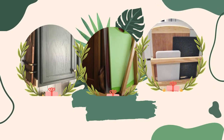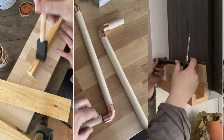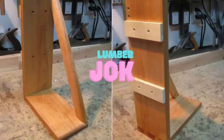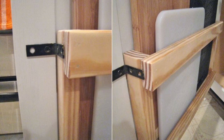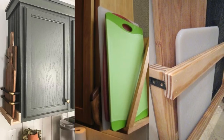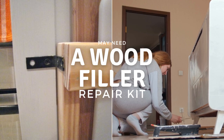Number 5: Three DIY Cutting Board Storage Hacks. First, from CaraFid, make a shelf ledge from three boards and wooden dowels with pipe connectors, attach to the cabinet using a nail gun and screws, and drill a hole through the cabinet for the dowel using a scrap spacer. Second, from Lumberjock, join a 16-inch backboard to a 10-inch shelf using 3/8-inch spacers and attach to the wall with drywall screws. Third, from Tommy and Ellie, measure the inset of the cabinet back, cut and nail scrap wood together with wood glue and a finish nailer, then attach to the door with L-brackets and paint to match. Pay attention to the weight of cutting boards and ensure the storage is strong enough to hold them.